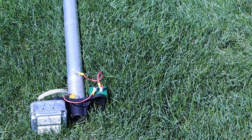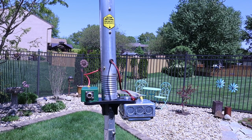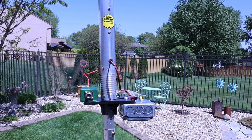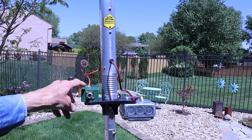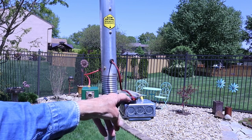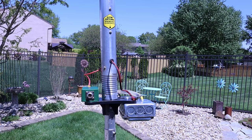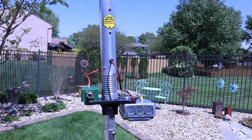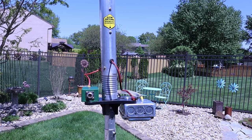There's the antenna mounted on the stand. You can see the speaker mount I used — I have another video explaining how we mounted everything. We've got the balun here and then the electrical box, which is what I'm going to plug all my extension cords into to become the radials for this antenna. The next step is to wire that up and get some coax run over to the operating position, and also run a line for the controller.